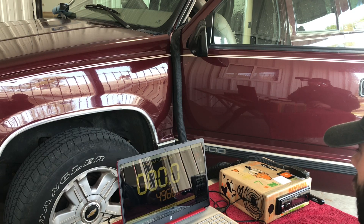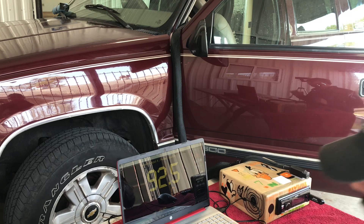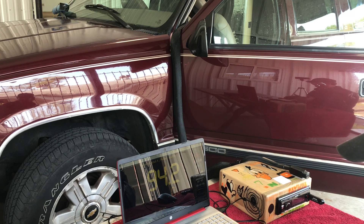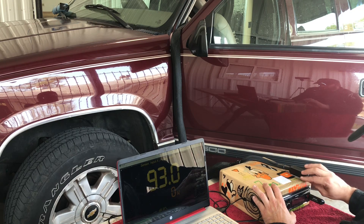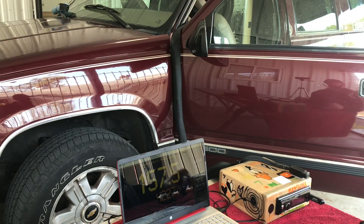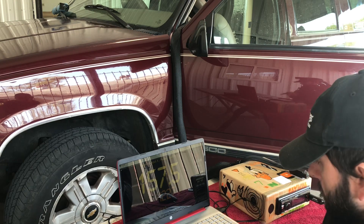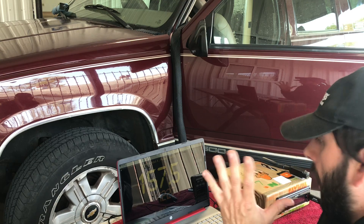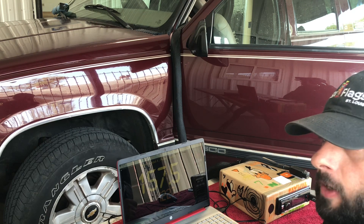Out of curiosity, let's see what 4,192 watts actually gets me, because that's supposed to be what it takes to do a 158 from a 155 for doubling power. It was a 157.5 — I was about 30 watts over. I lost 5 tenths of a dB doubling my power — it was only 2.5 dB louder. That's about 16 to 18% less efficient.